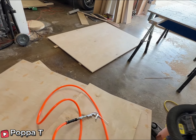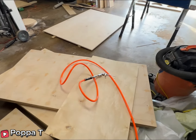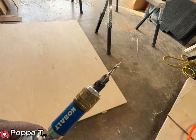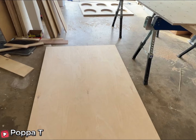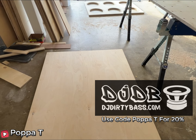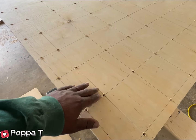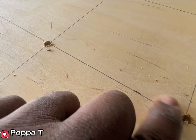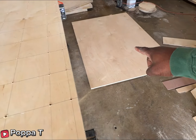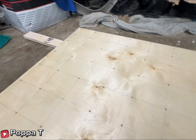Excuse me, I got a lot of sawdust in my nose, so y'all have to forgive me for all the sniffing you're going to hear in this video. So this is basically a countersink bit. I use inch-and-a-quarter screws. They'll kind of bite into the next wood without going all the way through with the countersink. You got to kind of barely tap it, give it a little bit of an indention. So whenever you put the glue down and spread the glue out on this piece right here that is going on, everything is pretty much solidified together.